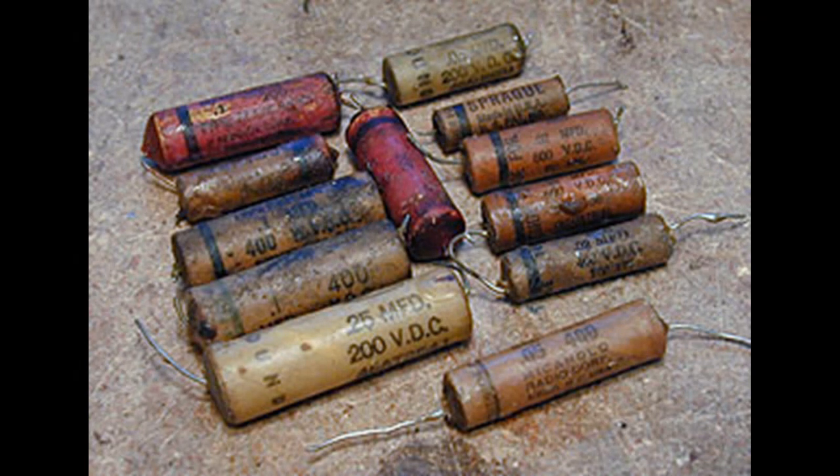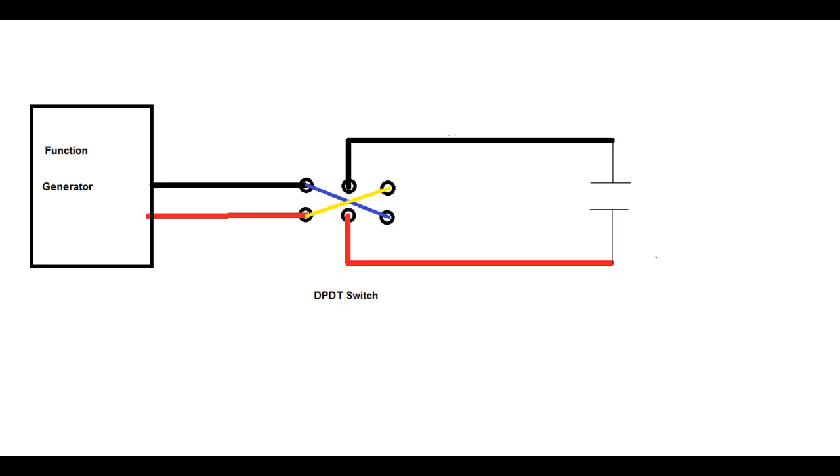Even given that, I'm going to demonstrate that our tracer does do the same thing. Because I have so much noise here, if I put my hands anywhere near the capacitor it would just pick it up like crazy. So what I did was make a little switching arrangement using a double pole double throw switch, so I could just slide the switch back and forth and switch which end of the capacitor is grounded, without putting my hands near it and negating the test.